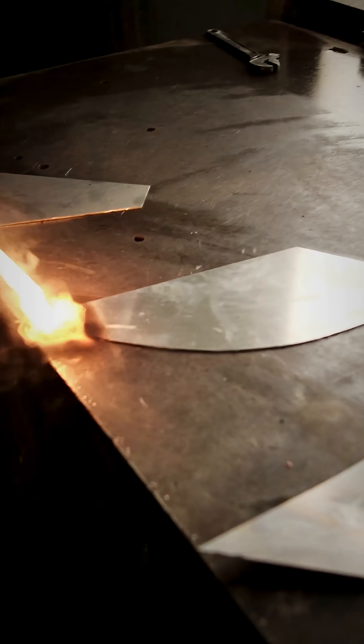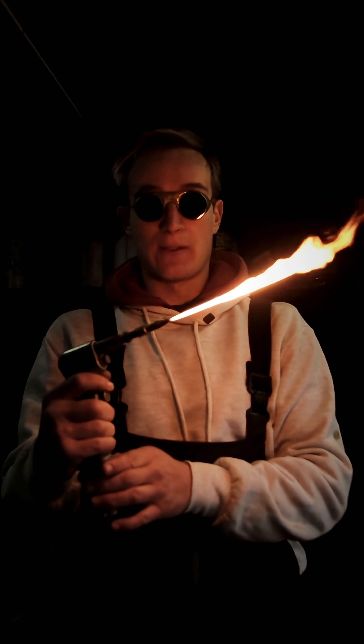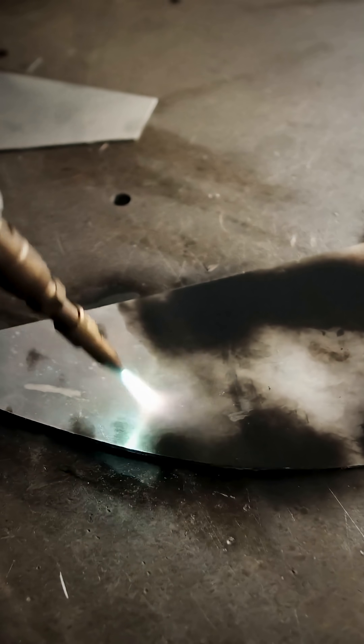With the soot method, just a slight amount — we don't want to add too much and get the panel too hot, because when we burn it off we could end up melting the aluminium. We go to the neutral flame and just be careful, jumping around the whole time. We don't want to overheat the panel and make it brittle — be very careful on the edges because they burn away and get brittle very quickly.